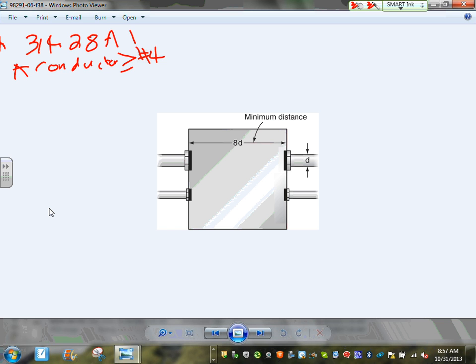Well, if your conductors are number six or smaller, here's the box, you're done. If your conductors are larger than number six, one of them number four or larger, this box is out the window, you have to have a bigger box.